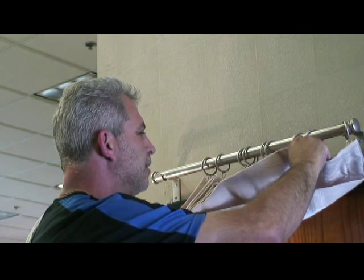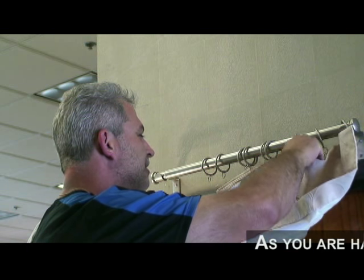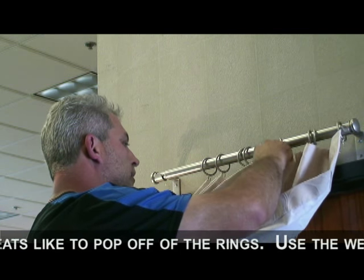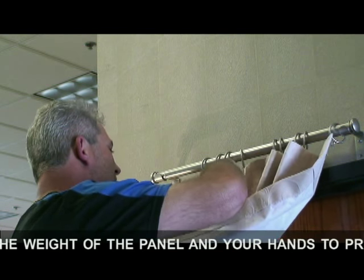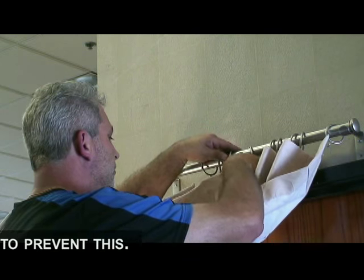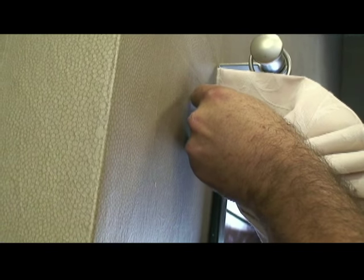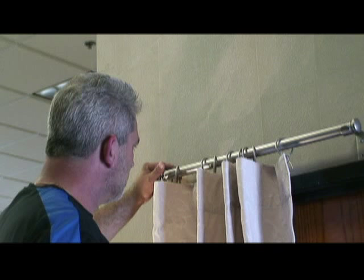Try to leave the panel in the plastic bag and tie it at the bottom. Lay the panel over your shoulder and keep the uncovered panel off the floor and away from your ladder. Always start hanging the panel on the overlap side with the first hook in the first ring. Place the return pin into the top of the bracket. Before we go any further, we need to double check that the drapery is at the proper clearance off the floor. If the length is not correct, we will need to either reset the hooks or reinstall the brackets. After we confirm that the finished length is correct in relationship to the floor, we can go back and install all the screws into the brackets.